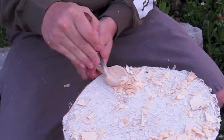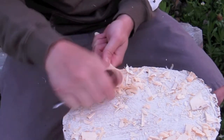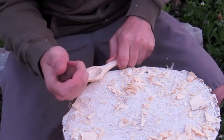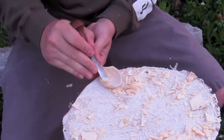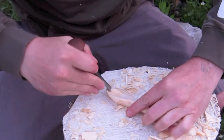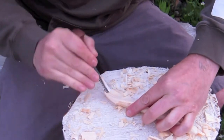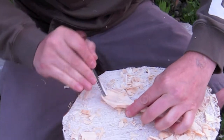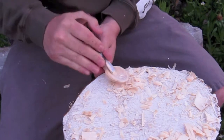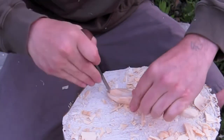I use my Flex Cut traveling roll — this size and shape. If you have other sweeps of gouge, a more shallow sweep, you can do some contour shaping. If you watch my other spoon carving videos, you'll see how to work the back of the spoon around the edges. This is about a #7 sweep, so you'd want a #5 and maybe a #3 for upside-down contour work.